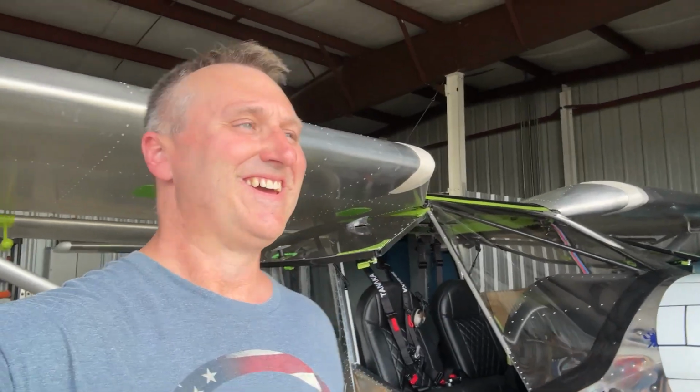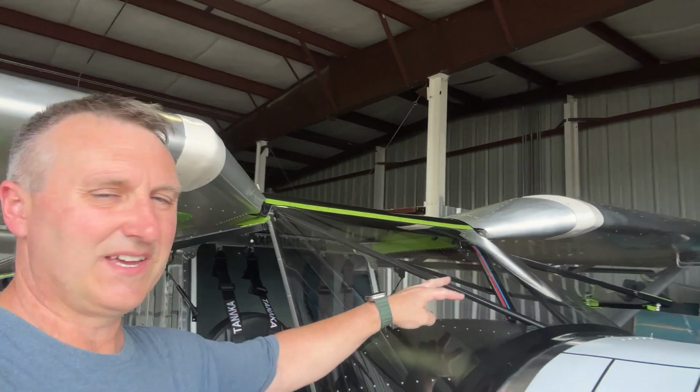I called GRT today, and there's a few issues I was just trying to sort out. I tell you, I can never just fly this plane. I guess that's a part of building your own plane and getting everything working right. Grand Rapids Technology, GRT. I talked to them about my GPS antennas. One of them is SafeFly 2020 ADS-B compliant. It will work for the ADS-B out as long as it's connected to a transponder, and it is.